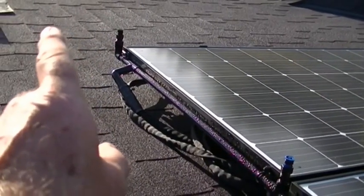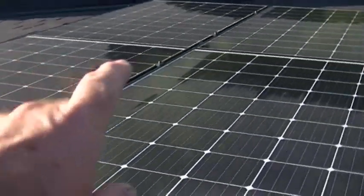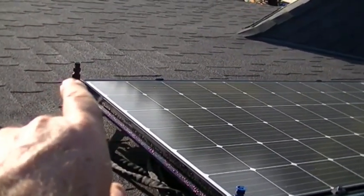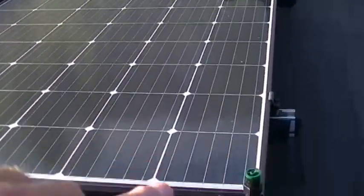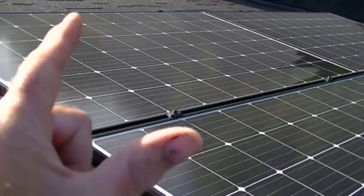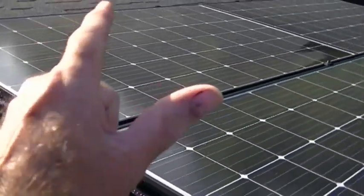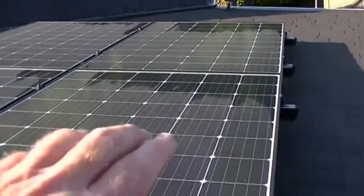On the end I've got a Van 8. The distance of this array is ten and a half feet on the height, and across is about six and a half feet, so I went with the Van 8. There's a little bit of overlap on each side on the roof but there's no avoiding that, and it reaches down fine. This one here is a Van 8 set at 90 degrees. In the middle I have a Van 10, set as a wedge shape pattern to reach the last two feet on either corner and all the way down. So with the Van 8 and that Van 10 in the middle — with 90 degree adjustment and a wedge shape to shoot it down and get that washed at the bottom — this one is set at 90 and it works out really well.